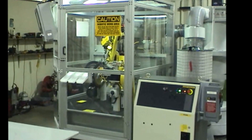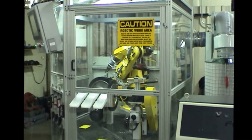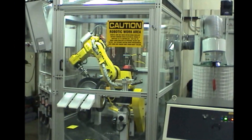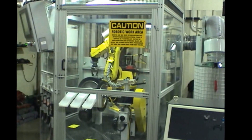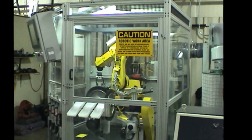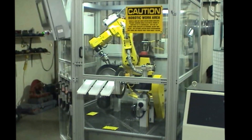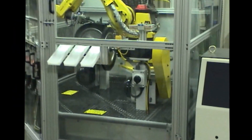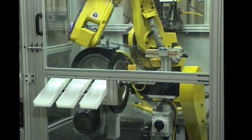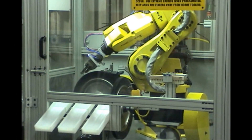I'm back here a little further to give you a better vantage view of how the work cell operates. You can hear from the dust collection system that it's very low noise — it comes out to less than 80 dB. There's close to 1,000 SCFM of downward draft. If you look at the top of the work cell, there are screens up there to allow air to enter and pull downwards, so the dust settles down at the bottom of the work cell. You can see there's a large pan down there for accumulation, plus a rubber-coated grate. We have a quick-change system on the polishing wheels — there are ball detents in there, you just grab and pull on the collar and the wheels will pop right off.